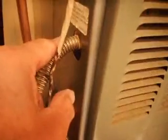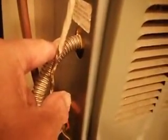So here we've got a flexible pipe. A flexible pipe is passed through this metal cabinetry, and the cabinet can cut the pipe. This has got to be fixed. You do not want to move in here with this in this condition, as if it does cut, you get leaking gas. In an open environment or closed environment, you could get a fire very rapidly.